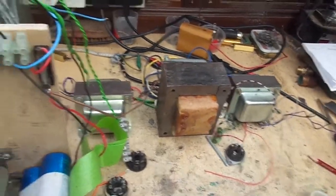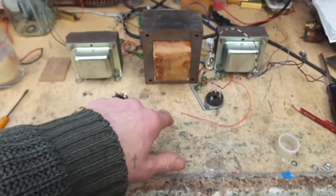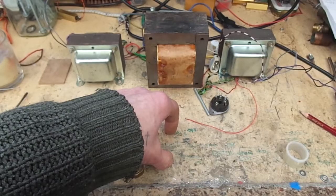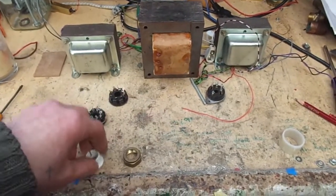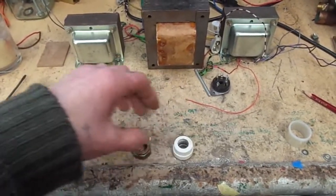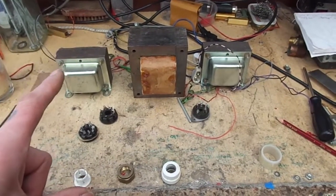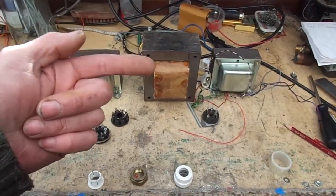Now then, the only other thing that we need to do is to wind it. We've got to have another transformer for the screen grid supply and the bias supply and maybe the heater supply for the input valve and tone stack circuitry. So I am going to wind my own. I've already started on that. We'll have a look at that in the next video.